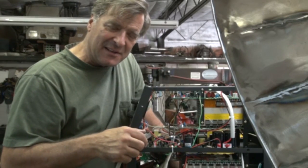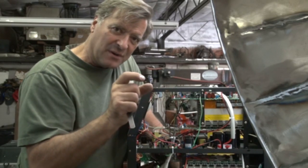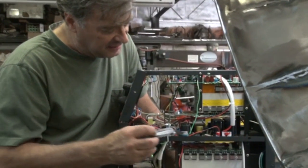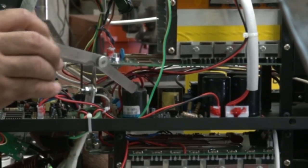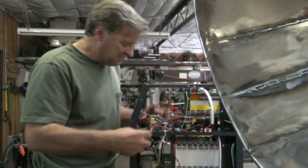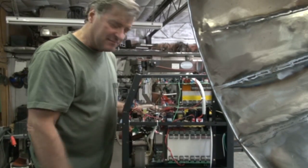So let me just go ahead and put all this back together. Now, if you're going to do this on your machine, remember they may not look like this, but they're probably going to be right in that area — and they'll just look like a pair of contact points. Either they're going to be fixed like this one, or some of them actually move. This front portion of the machine right in here is probably what's called the high-frequency board. You'll just look around and see those little contacts in there somewhere. A lot of times I've found them on the front left corner of the machine, right behind the control panel — not on the back, not down where the transformer is, but up in this area.